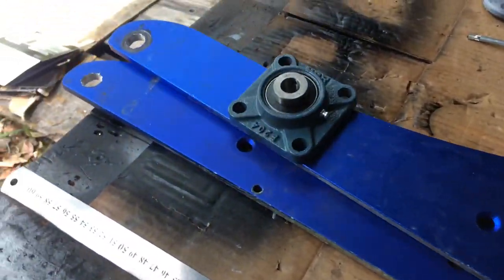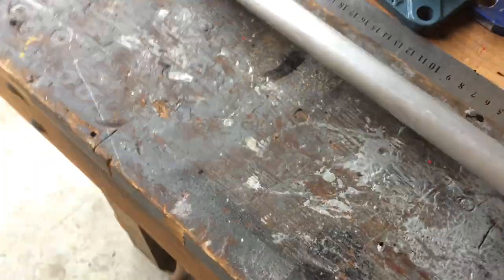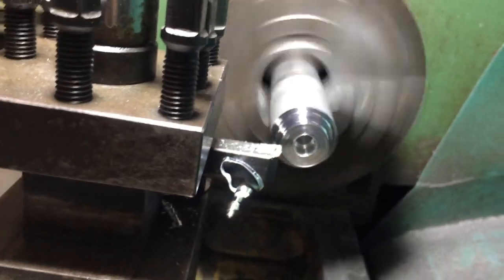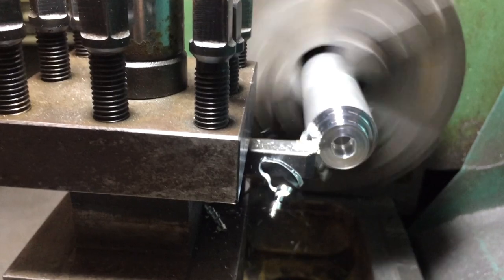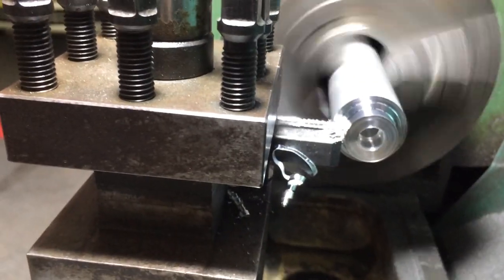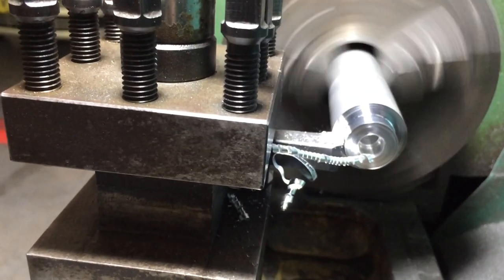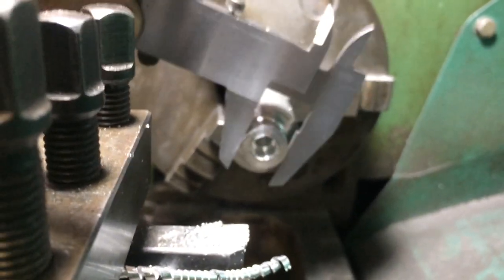The first thing I want to do is set the width of these two things apart. I'm going to use these bolts here — one of them and one of the bigger ones — and that'll just make the frame for it. I've got a little stand for this but it'll be hard to set it up. You've got to take this down to 19mm and then tap it. It's 9mm deep. It's just going to sit in that frame thing I've got there. I'll just check the depth. Alright, that's a nice tight fit.